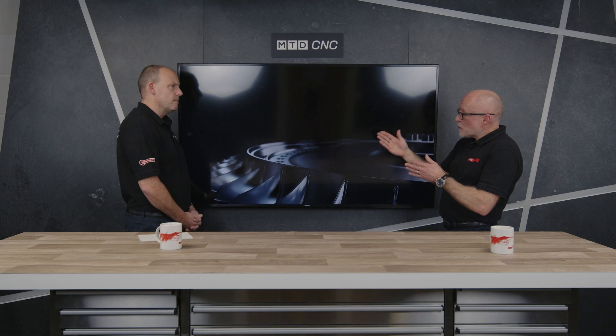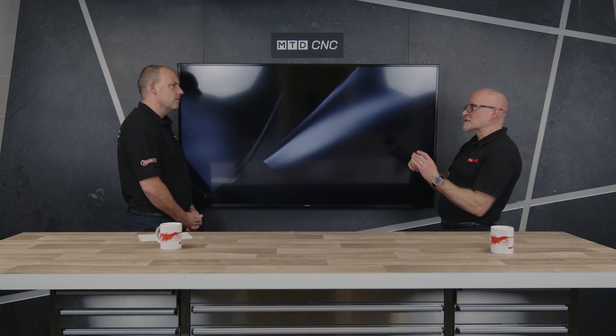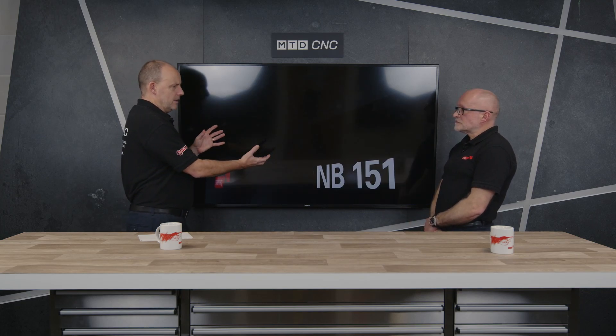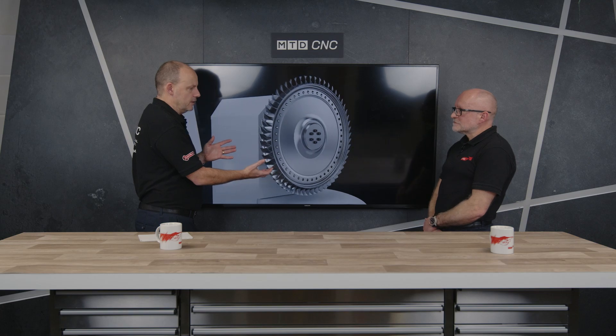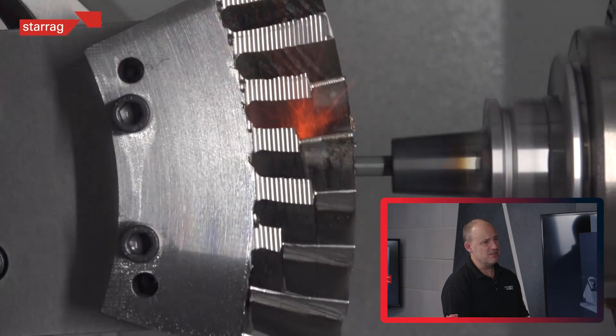There's no straight answer to that because every different blisk has its own different strategy. There are some blisks that are actually water-jetted before they're even offered to the machining center. Some come in as solid, some have short stiff blades, some have very long thin blades. Some machine opposing aerofoils, some machine all the way around the aerofoil, some machine almost as a pocket. Different blisks, different materials, different lengths have different strategies. And when it comes to making a part like this — clearly it's a critical part of an aircraft engine — what sort of tolerances and precision do you look to achieve?